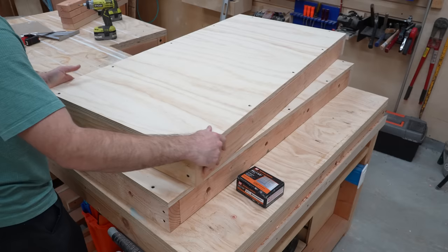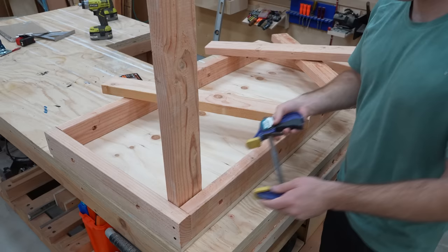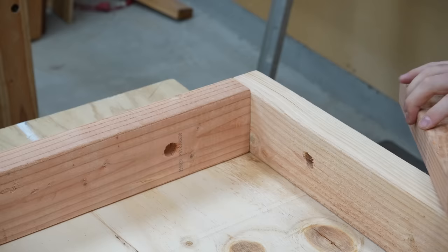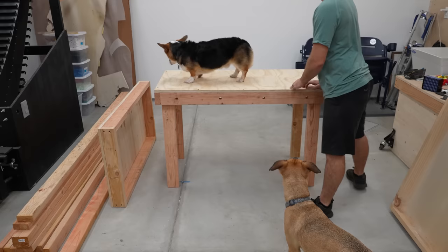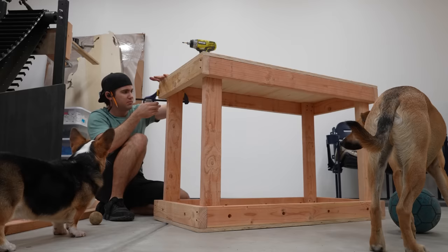We now have the bottom and top completed. Next, let's add the legs. I took the top and flipped it upside down. The long edge of the board goes on the long edge of the platform. I used a clamp to press it into the corner and hold it steady. I drove the screws in without pilot holes and only had minimal cracking — you could drill pilot holes if you like, and you could also drive the screws in from the outside. Each leg should get at least three screws, preferably four to make it super sturdy. Now I can add the bottom: flip the table upside down and place the bottom on top, making sure to pull down on the table before clamping and driving in screws so there aren't any gaps.